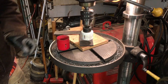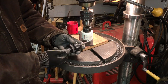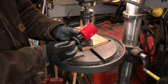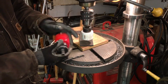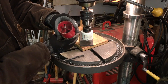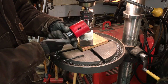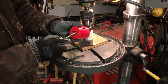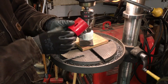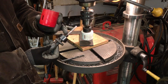To start with, I'd like to show you a hack for preventing the breaking of the quarter-inch pilot bit that goes in your hole saw. This is the assembly that screws into the back of the hole saw — it lets you chuck this into a drill, either a hand power drill or a drill press like the one I have here. You screw it in, line up the holes inside with the two pins, and those two pins drive forward into the receiving holes in the hole saw. That engages it so that the torque transfers to the large hole saw without breaking things and without making the screw thread too tight.